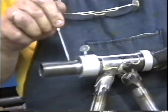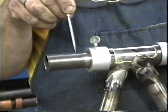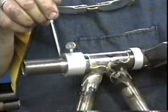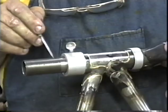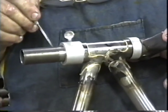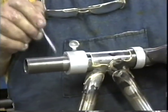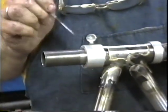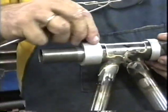I'm going to cut right here, right there. I'm going to cut right there, and then I'm going to add 25 millimeters of threads from here to about here. And the reason I'm going to cut a little bit above where the threads end is these original threads will help me start the tap. So don't cut off all of your original threads. You need to use them to get your tap going. So let's go over and put 25 millimeters more thread on here.